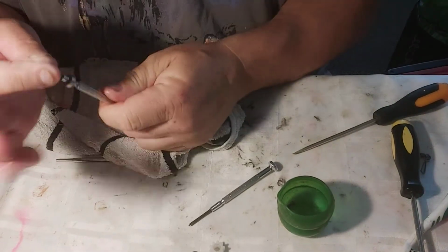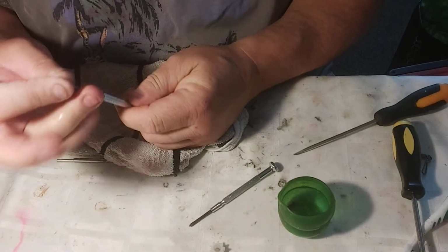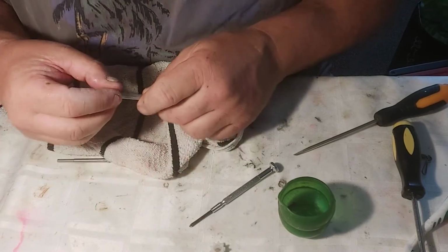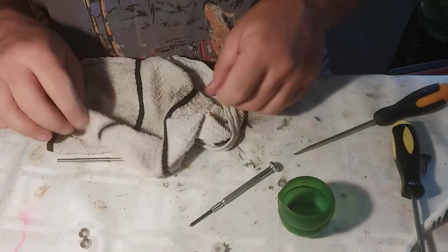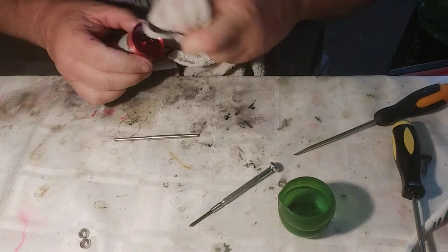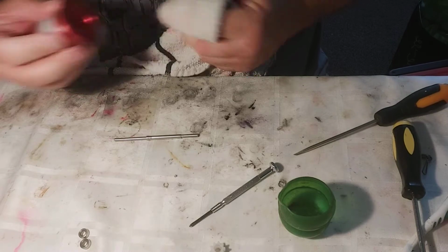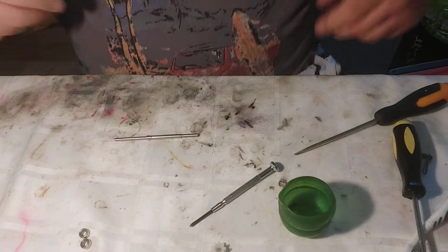Give them a little clean. And again, you can hear them once they spin up and they dry out. They're cushy. Okay. So we've got both our bearings all cleaned out, nice and clean. So just dry my hands off, clean the spindle, give that a little wipe through. So that's nice and clean, nothing on the inside. Okay, so we're ready for reassemble.